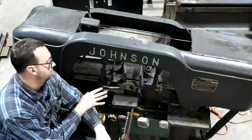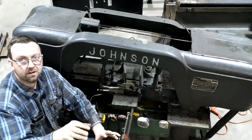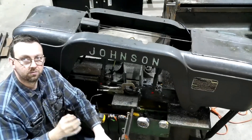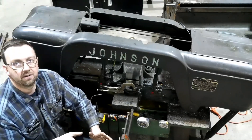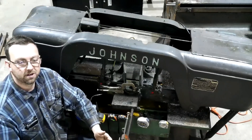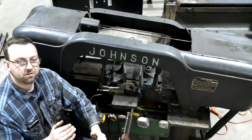All right. We've got our first piece over here in the bandsaw. You're probably wondering — you saw me punch them. What I was doing was numbering them. Each one is numbered. When we split it, it's not going to be perfect. With the bandsaw I just won't be able to get it absolutely perfect. If I was using the slitting saw, yeah, that I could get perfect and I wouldn't worry too much. But still, I would mark them no matter what and make sure they're numbered.